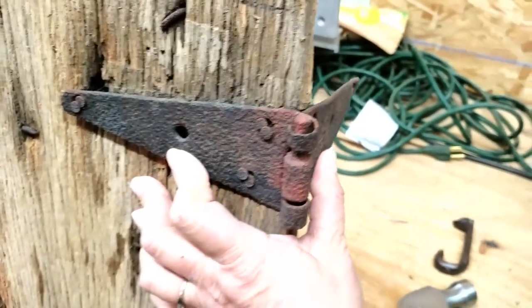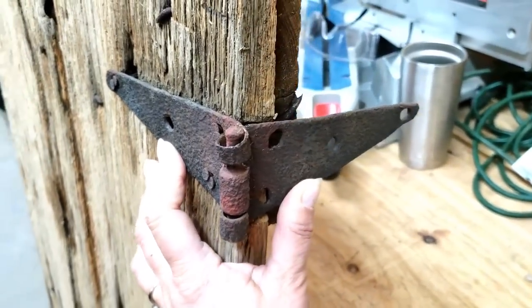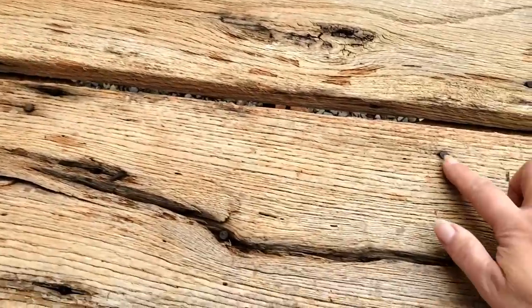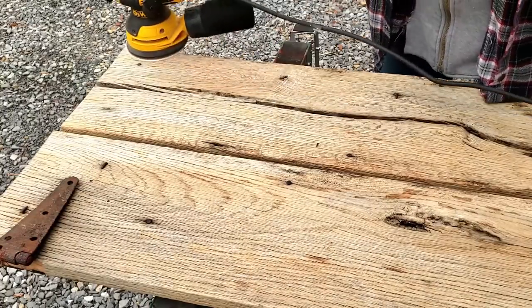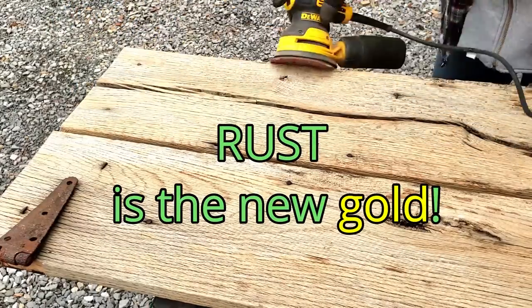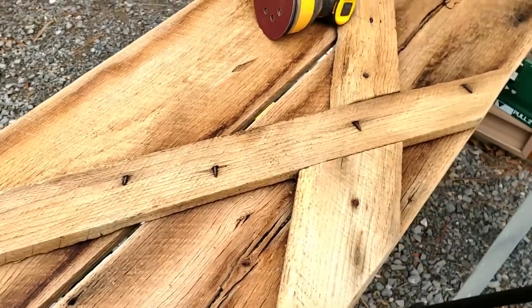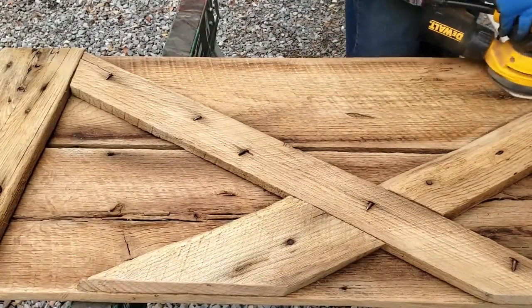So once I got them trimmed, I looked at them and that was good. I wanted them at a nice 90 degree angle so you don't run into them with your legs. When I pressure washed the wood, it really brought out some of that roughness. So I was going to just sand it lightly with maybe a 120 and a 220. And you can see there's a lot of original old nails in there. I was very careful not to sand over those, because I wanted to keep that rust — that rust is such a nice patina. Once you start sanding over it, it'll just show like a shiny new nail, which I definitely didn't want. So the back side was pretty rough too, but I just hit it with a 120 to take the roughness off of it.